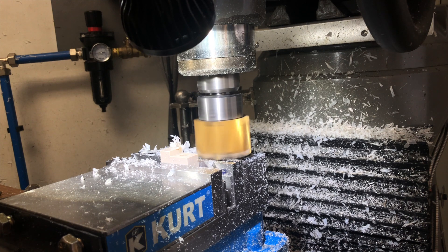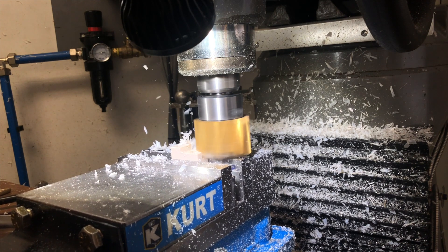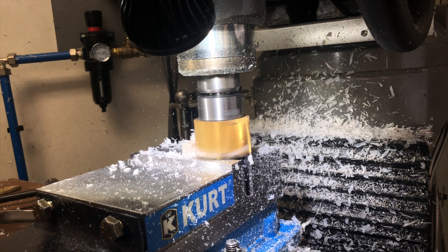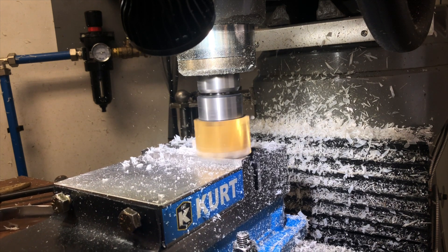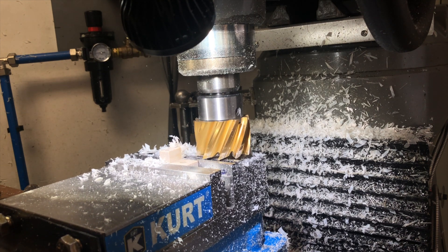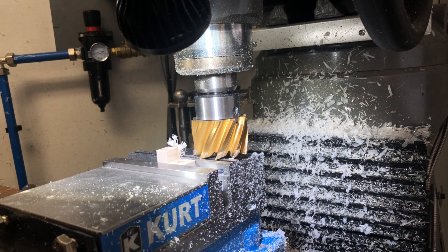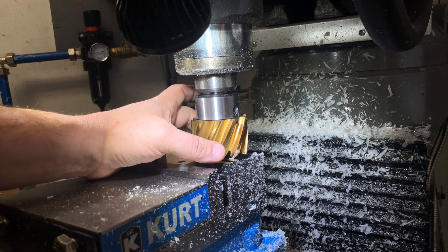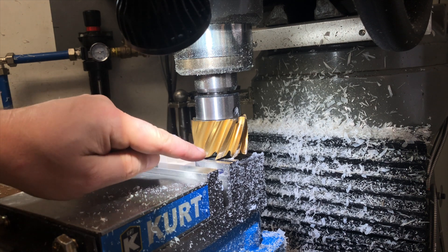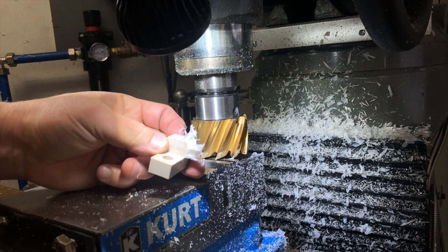Now we come back down to full depth, which is very, very close to the vise. You can see it's fragmenting a little bit, but it clears up right when you get to the end of the cut, because the geometry changes and doesn't lend itself to the chipping. A lot of thought went into how to approach this cut — because you've got to watch the way this big shell mill works, the way the flutes are coming around. As they're coming this way they're chipping out, but as you get closer through the cut, the way they come through, they're actually cutting in at that point.